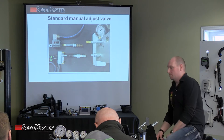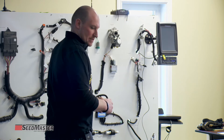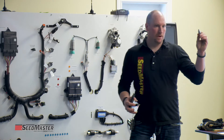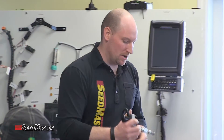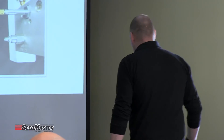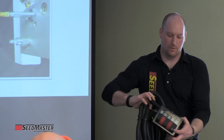If you happen to look at it — who's got that relief valve that went around? What we're seeing there is that that gear motor is operating a relief valve. Do you guys remember what I passed this around for? Wing down pressure. In the old style blocks, wing down pressure was the same relief valve as shank down pressure. So that setup there, if you pass it around, is what the manual switch blocks used to actually increase and decrease the opener down pressure.